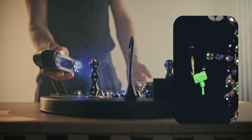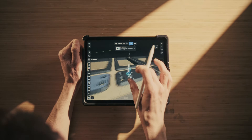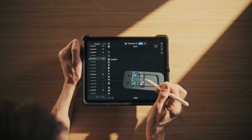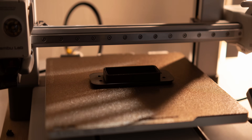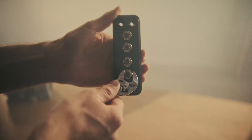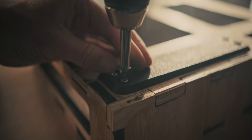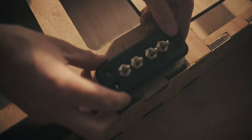I still had some 24-volt switches laying around. I 3D scanned one and integrated it into a small panel at the front. This lets you hook it up to one or four USB cables and turn off chargers you don't use as often, because sometimes batteries keep soaking power even when they're not actually doing anything. I left the rest of the panel somewhat blank, but we can upgrade it later with more switches or USB ports.